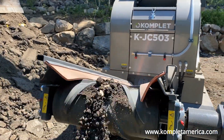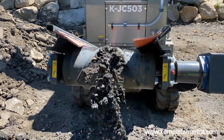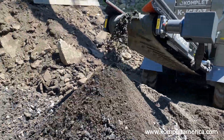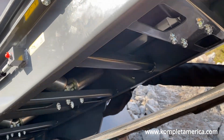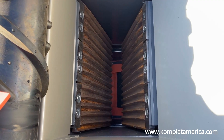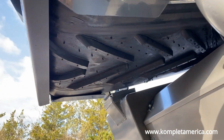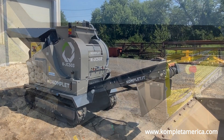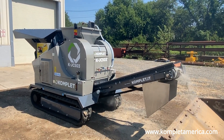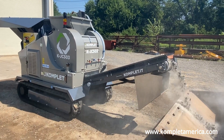Also, be sure to periodically check and adjust your belts so they have proper tension and are center aligned to prevent them from slipping and suffering unnecessary wear. After using the machine, always be sure to clean and check the belt rollers, hopper, and jaw chamber and remove any built-up material that can cause wear over time. Always be sure to grease all grease points every 8 hours as well as check the air filter periodically to ensure optimal operating conditions.